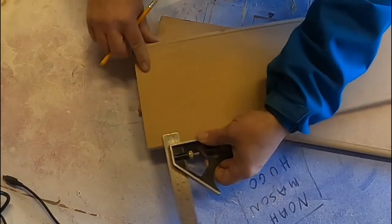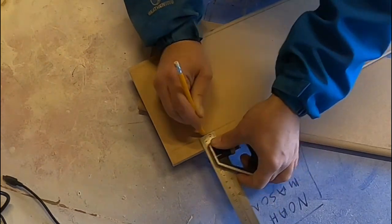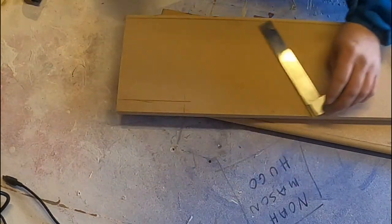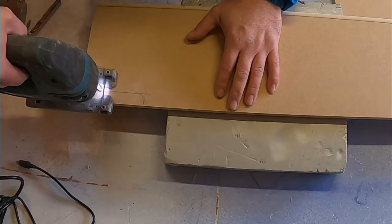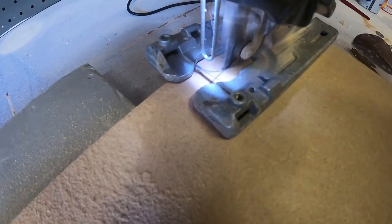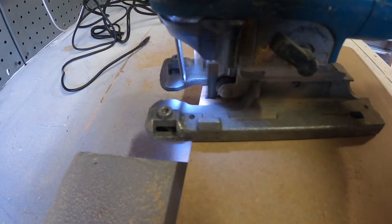What I'm doing now is measuring the cutout for a skirting board — this will vary depending on what skirting you use. Just squaring that off, and I'm using a washer there just to create a rounded edge. Then cutting it out with a jigsaw — I've got a bit of foam insulation underneath to stop it hitting the bench. The jigsaw bit was a bit big so it wouldn't turn very well, a bit too thick, but I did it okay.